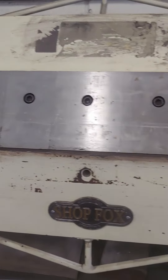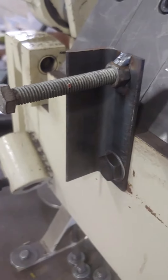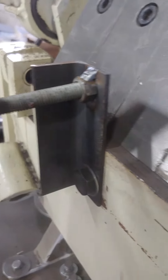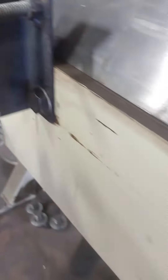I had this box pan brake. I took off the bottom lip that sits here so that all I have is this little flange. And I made this stop — you see it's adjustable. The screw goes in and out; you can adjust it however you need. This one's just sticking out a little bit, enough to give me a 45.